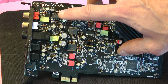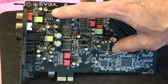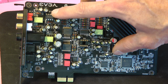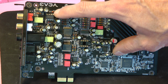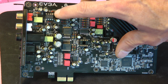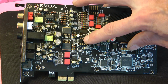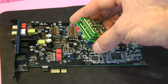According to the specifications, this op amp only runs at a maximum of 6 volts, and I believe the socket itself puts out a maximum of 6 volts. So this is important. The op amp in here, which I could look up, it's an Analog Devices something or other. It's special apparently in that it runs at 5 volts apparently, I think. It could run at 6, but basically the circuit for the line outs is made especially for this op amp, so we don't change this. There are in fact op amps that I've looked up that have the specs that should match this. The Muses 01 is one of them. I haven't done it because I'll get into that, but this one is more important to me because I bought this board as a platform for this op amp.